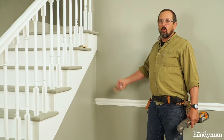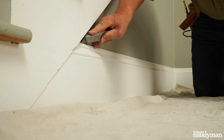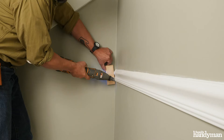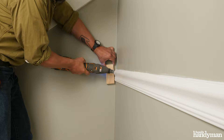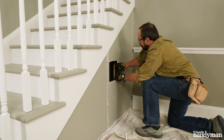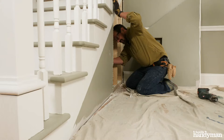Before we tear off our wall covering, we want to get our trim off. I'm going to use a utility knife to score the top of the baseboard and pull that off. Then, because I have trim on this adjoining wall, I'm going to use a piece of three-quarter trim and this oscillating tool so that I can cut it back three-quarters to receive my new trim when it goes in.